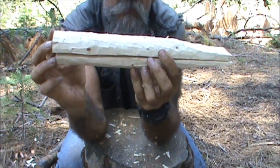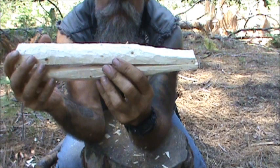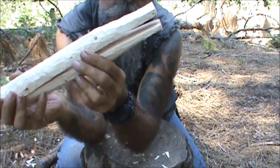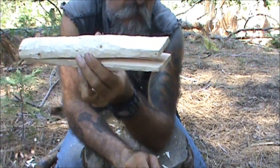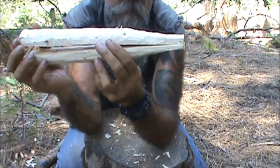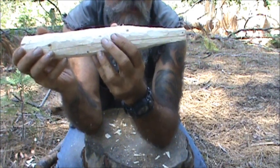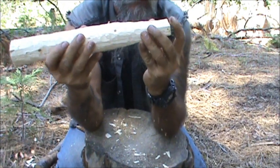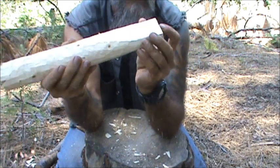And when we rock this down on this fulcrum, the jaws will open. Actually, we want the jaws to open, I figure probably about an inch maximum to accommodate an item of that size. Once we get that done, then we're going to move to the next phase, and I'll show you how we're going to use a lever and fulcrum setup on this to tighten these jaws down and hold an item securely. This will act as a third hand.